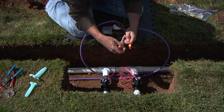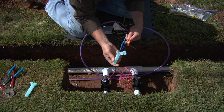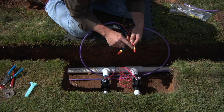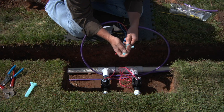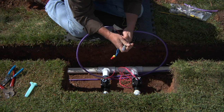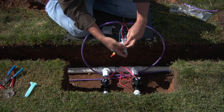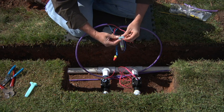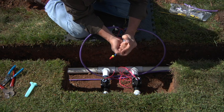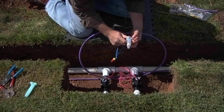Now that you've got your wire nuts in place, we'll use the capsules from the DBRY connectors. Regular greased wire nuts will not hold up down the road — you will get water intrusion. You want a true waterproof connector. Slide the wire nut all the way into the bottom until it seats, and you've got enough for a three-wire splice. Separate out the three wires in the cap, then simply snap the cap over — you'll hear a click. And there's a good waterproof connector that'll last the lifetime of the system.